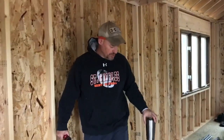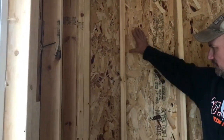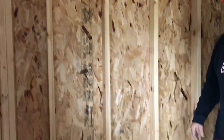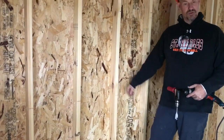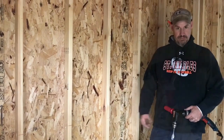We're here in our small cabin in Longville, Minnesota, and we are preparing to run some wire. We're going to do a basic wiring setup with essentially outlets, a couple of overhead lights, and a couple of switches. First thing we need to do is locate where our service panel is going to come in. We're using a three-quarter inch drill bit and going through the studs right in the middle — we're two-by-four framing. We'll come back and talk about how we're going to run the wire after that.